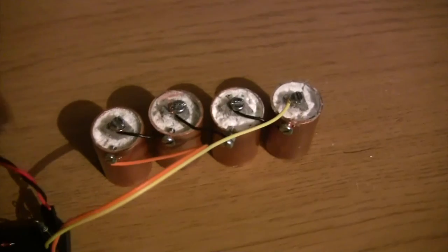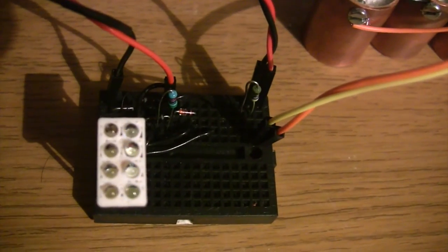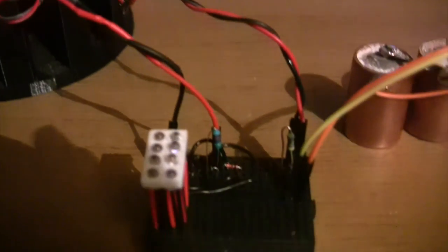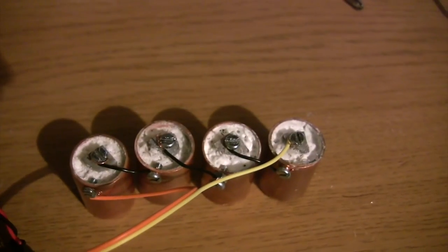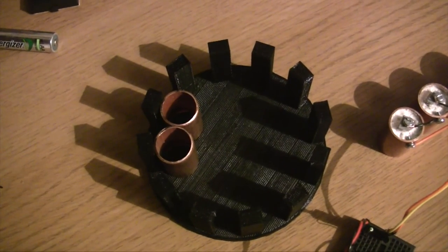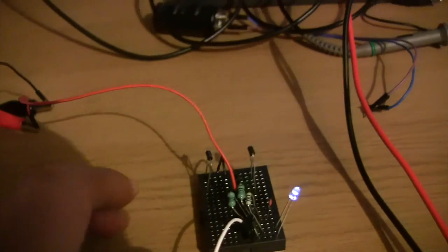I screwed the M3 bolts into the holes and wired the cells up in series. As you can see, it actually powers the EasySpin and flashes the LEDs. The LEDs flash because it's alternating current. On the breadboard it did have a rectifier, capacitor, and all sorts of things, but all those discrete components consume electricity and made the lights a little dimmer. So in the final design I did away with all that — it's just AC straight out to the LEDs. The way you wire them up makes them flash in various ways depending on where you put the LEDs, giving a kind of computer-display effect — but really it's nothing more than AC voltage.